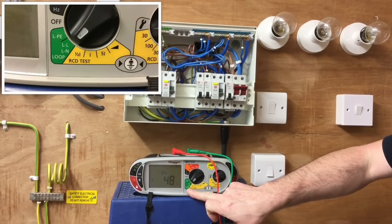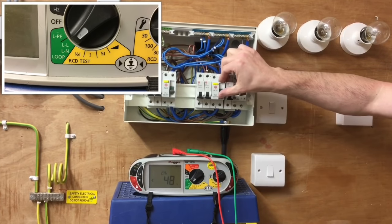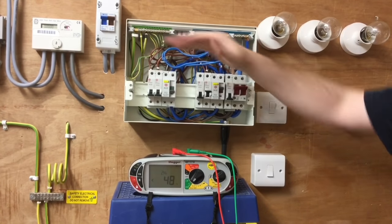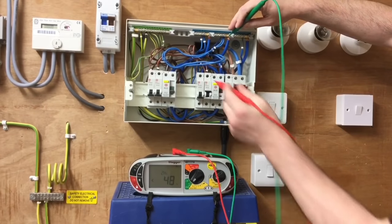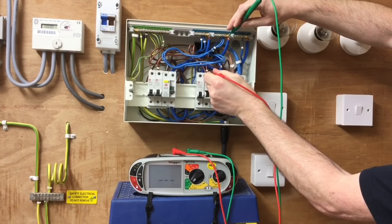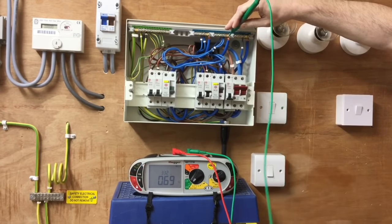I've reset my instrument back between line and neutral and moved my probe into the blue section at the top of the instrument. I turn on the RCCB and turn on the circuit breaker to test — it wouldn't matter which of the circuit breakers we selected. Probing on the least dangerous first — neutral — onto the top of the line. We've got 332 amps, then off the line and off the neutral.